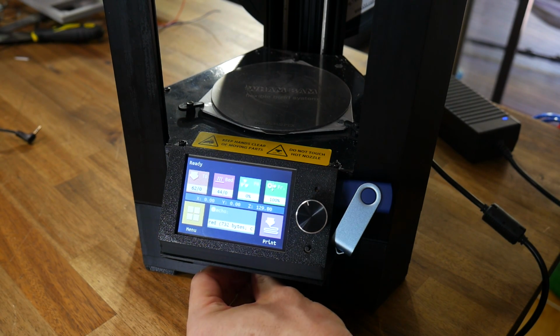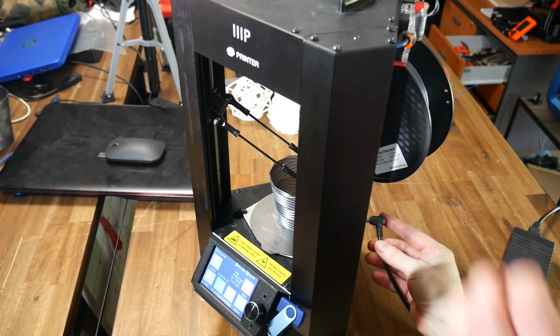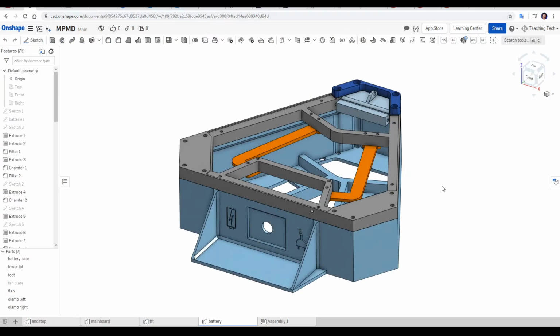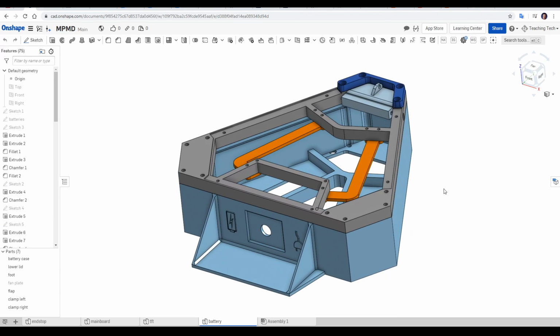When we switch off the printer normally, the capacitors keep it running for a split second. This means that if we flick the switch between the 2 power sources fast enough, we can change from LiPo to external and vice versa without interrupting printing. Fitment is actually quite straightforward, and the main concern is printing all of these parts, none of which require support.